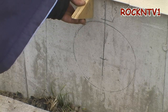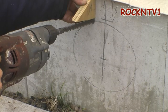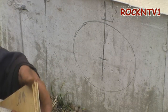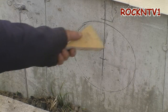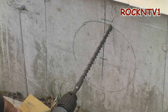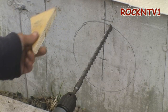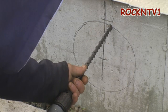I'm going to use my little angle guide to keep orientated — that will keep me at my angle, and with any luck the pipe is going to come out right through the wall and line up with that elbow. I've made the circle about a half inch bigger than the pipe and I'm going to run my half-inch drill bit around the outside of that circle. With any luck she's going to come through nicely on the other side, and I'll do a little cleanup with the air chisel and rattle hammer. Make sure you have more than one drill bit just in case.